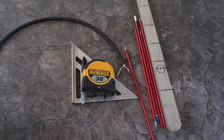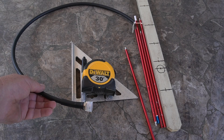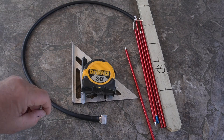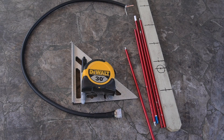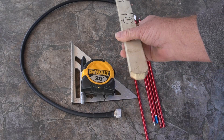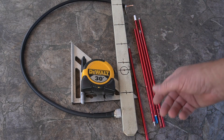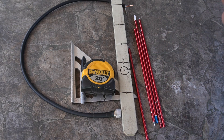A lot of times you'll see a Yagi set horizontal, but this one's gonna be vertical — it's like FM. I may try both but for now that's what it's gonna be. The really cool thing about doing Yagis for the higher bands is that this is nine elements and it's about two feet long. I'm gonna drill all the holes using a drill press. You can use a regular drill — just be careful to get them as straight as possible — but if you have a drill press, use it.